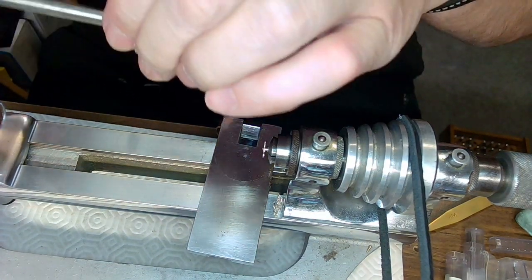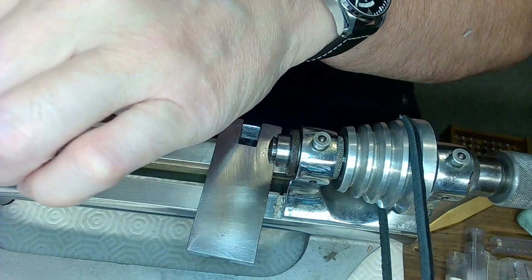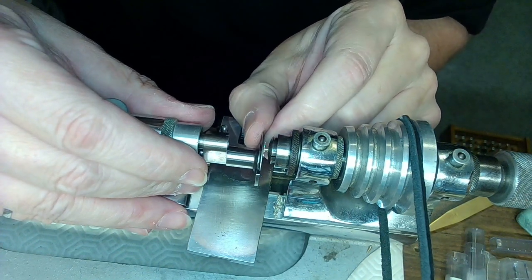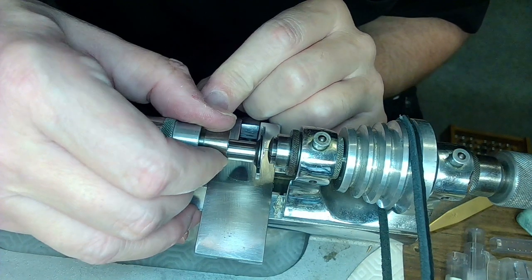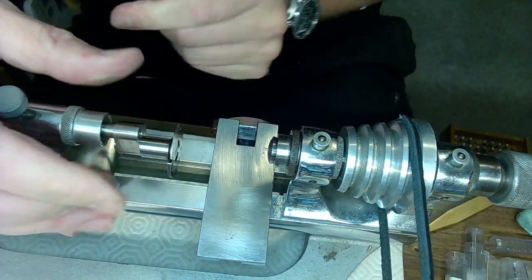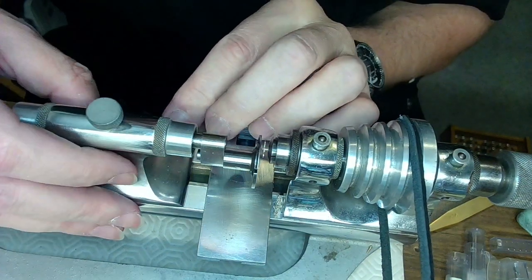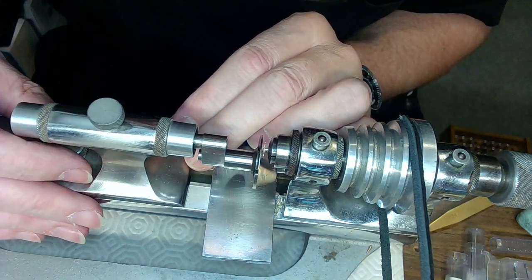And maybe what I want to do here is put this back in when it's loose and then butt it up against the part and make sure that thing rotates perfectly, right? That might be the better way of centering it. So it's live and learn, as they say, right? So that's where it was. So if I do this, that's directly in the center of that part. So if I tighten it now, that's not bad there. So back that off, tighten it, move it forward, and then tighten. I want to move this out just a bit, and I want to tighten the lathe here. That's tight on top, and then the lathe bed, I need to tighten the lathe bed.